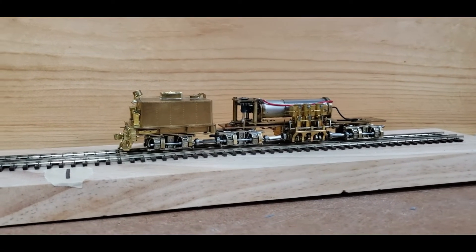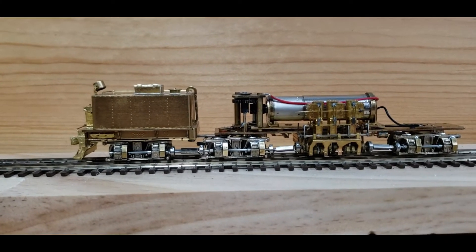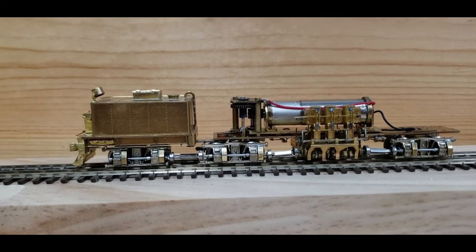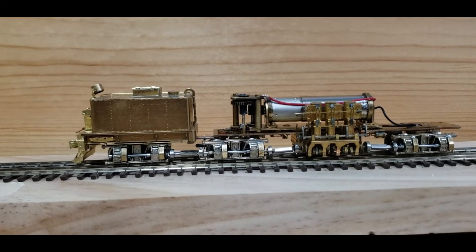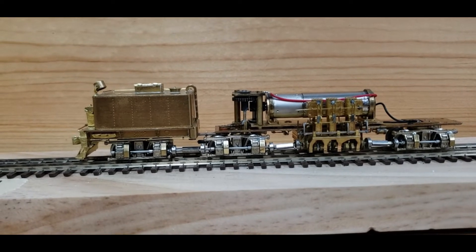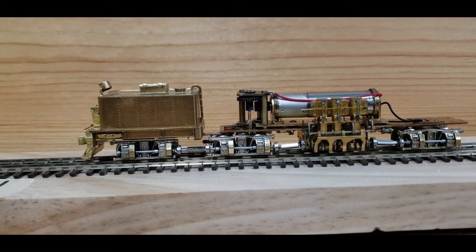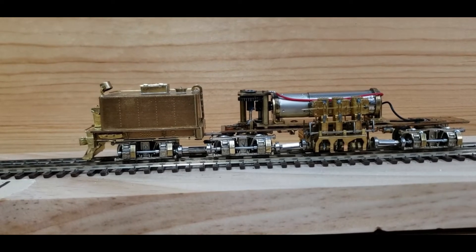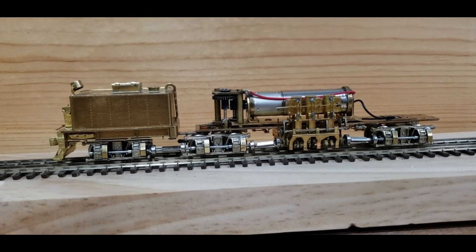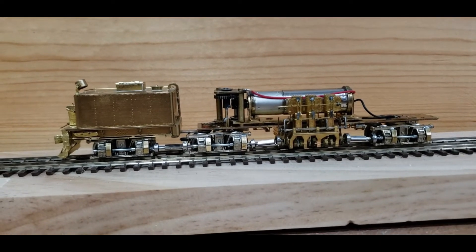One of the fundamental problems is this drive. You can see this cardan shaft being driven by a bull gear, driven off a spur gear, which comes off a pair of helical gears that goes through the gear head and is driven by a spur gear in the motor. It's so bizarre. Then there's another set of helical gears in the truck that transmit power from the vertical shaft to the wheels — this is a total Rube Goldberg.